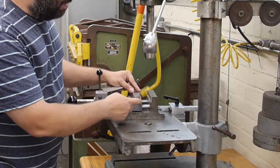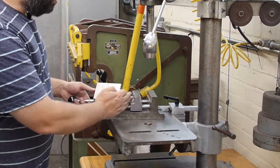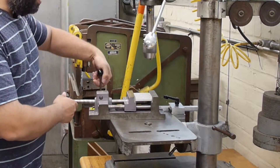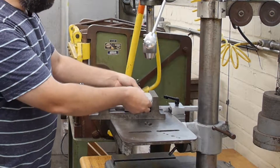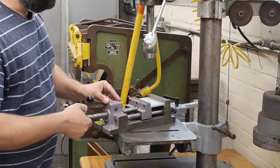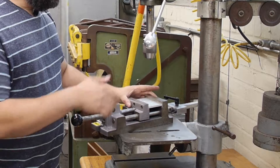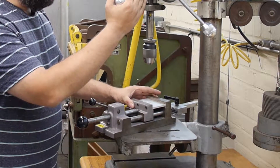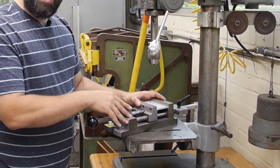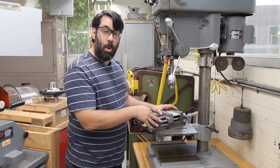We always have one mounted to the table of the machine. As you can see, this vise has a nice set of parallels built into it — that's a nice design feature. So if this is my workpiece, I simply open the vise jaws, insert my workpiece, close the jaws, and actuate the locking lever on top of the vise, and now the vise has a secure clamping on my workpiece. This particular vise has a clamp that also secures it to the table, so I would load my drill, position my part where I want it, and then as the last step, I simply tighten the clamp handle, and that's going to hold my part in the vise and hold the vise to the table securely while I drill the holes I want in my workpiece.